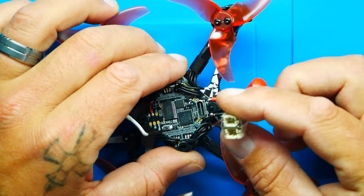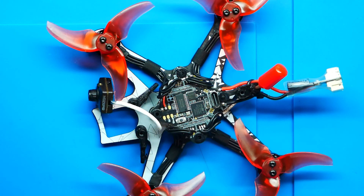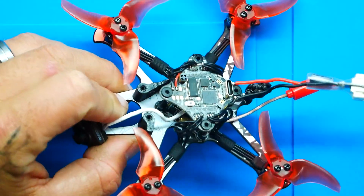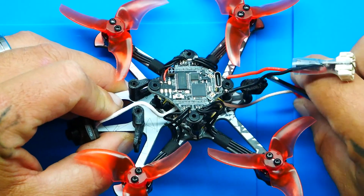You can see we've got our battery connector, and this is a dual setup, so we're going to need two 1S batteries — something like these Nitro Nectars. So let's break the antenna out, and that is connected by UFL. I'm going to get in there with something that's not going to cause damage and pop that off. There is our antenna that comes with this quadcopter.